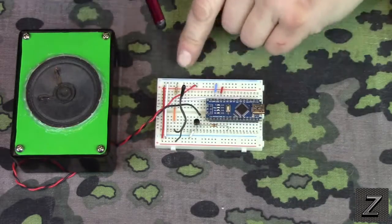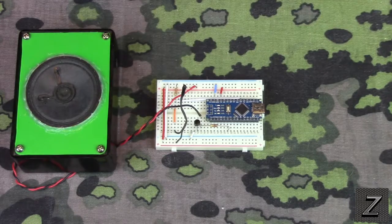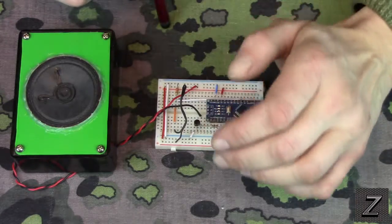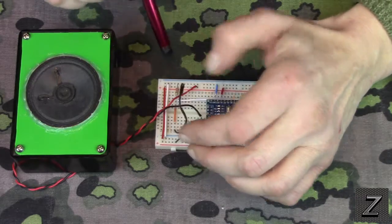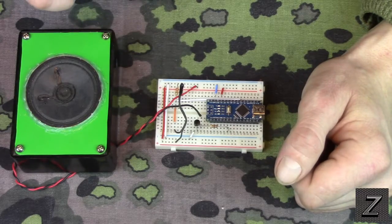And we got it set up like a voltage divider so we get better, more accurate readings. So what we got right here is a resistor, and you'll see that on the schematic. I'm using a 22K. But after you build this and put it together, you might want to play around with just a little bit bigger and a little bit smaller while you have it hooked to your serial monitor, monitoring the values. Depending on your thermistor, because there's lots of different ones, you might need a slightly bigger, slightly smaller resistor. But I'll have more info about that on the website as well.